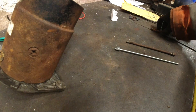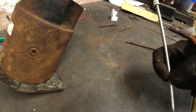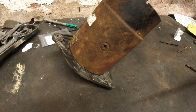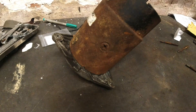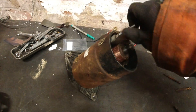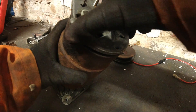I'm ready to assemble this. When I took it apart, one of the bolts completely snapped — it was massively corroded. Instead of using a new bolt I've got some M6 studding and I'm going to put that in instead. I've cut it roughly the length I want plus a bit longer, and then that can just go into the threaded hole in the aluminium base. As long as I put two nuts on it, it should hold it in place. I'm going to put that stud in now so I can put the cover on top of it — I just wind it in. Obviously I don't want it protruding too far out the other end. On the trial fit it works, so I'll take it back off again.